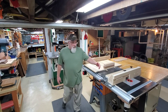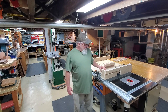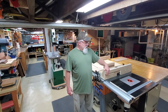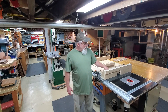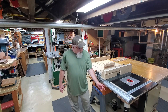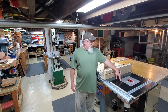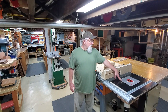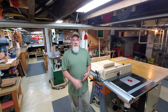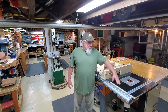I also integrated a router into my table saw setup, creating a fence that attaches to the table saw fence with sliding adjustable faces on the front. One face got chewed up on my last project so I need to replace it, but I still have the hardware. There's dust collection at the top, and I also have my dust collector tied into a box over the router itself. I have a Woodpecker aluminum plate with a Bosch 1617 router mounted to it — I like the 1617 because I can use the T-handle wrench to adjust bit height after it's in place. It's a plywood top, painted and shellacked, kept waxed, and it does a fairly good job.